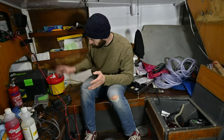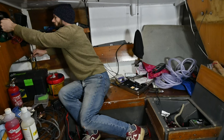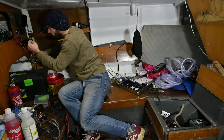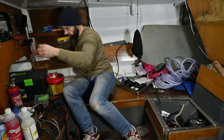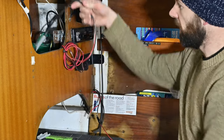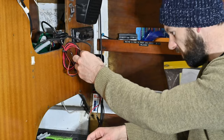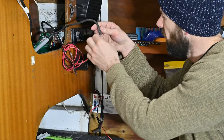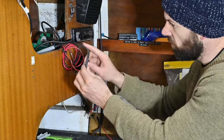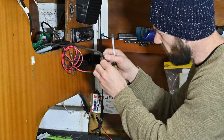12 volts is not getting to the fuse. My join is downstream of that — so there's another connection somewhere. Further downstream, before it goes into this big bit of black insulated cable and into the abyss where I hope there aren't any further joins, there appears to be some kind of connection. There's a bit of heat shrink over this — something is hiding under here.